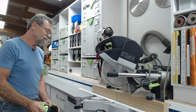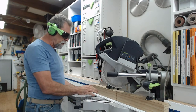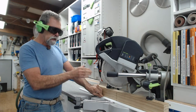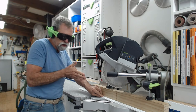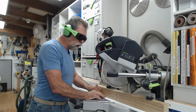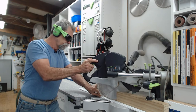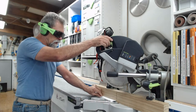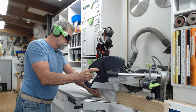You try and do the right thing. I've already marked it off to length for one direction. When I'm cutting this, I have to hold it extremely tight back away from the blade. If I don't hold on tightly with aluminium or even with timber, as I'm cutting at 45 degrees it wants to pull the material along, which ends up pulling things in if you're not very careful. So a lot of force — more than you think you might need.